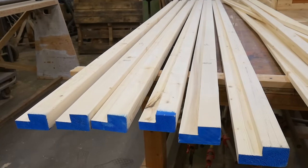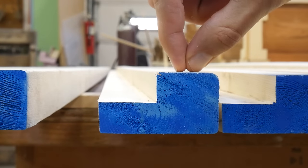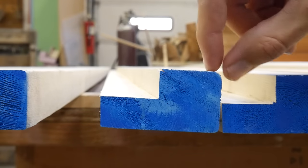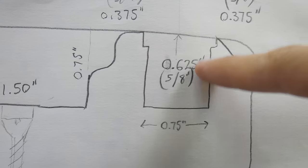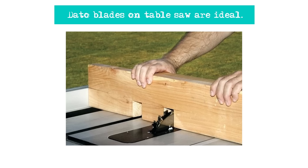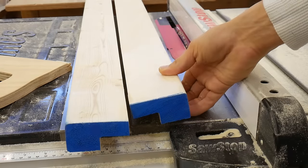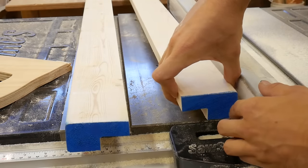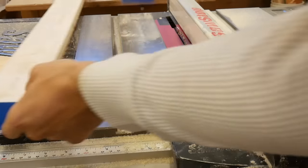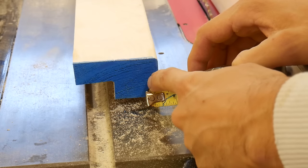This is the current state of the six boards. We got that nice chunk taken out and we're ready to do the glazing channel. The glass is going to come in right about like that. The glass itself is three-quarters of an inch thick — two eighth-inch panes with a half-inch gap in the middle — and then we'll do three-eighths of an inch on either side for support. If you have a three-quarter inch wide router, that would be super easy, but I want to show how to do it on the table saw. We're just going to do slice by slice — about six slices. We want to have three-eighths of an inch of wood and then that gap for the glass, making sure we have a solid three-eighths of an inch space to the inside of the blade.